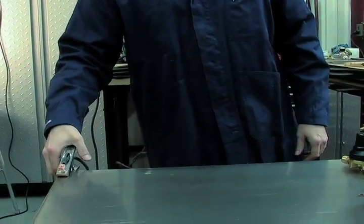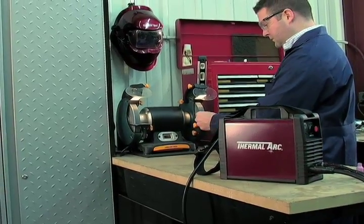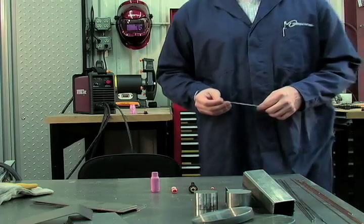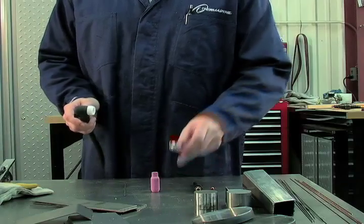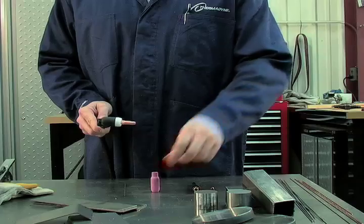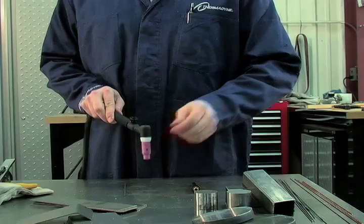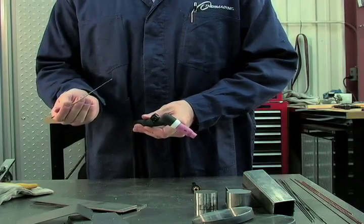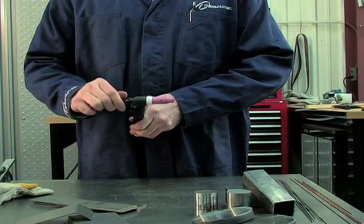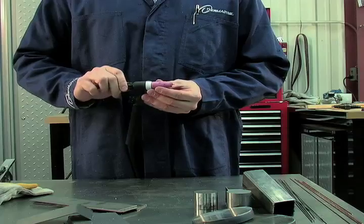Connect the ground clamp to your workpiece. The tungsten must be ground to a blunt point in order to achieve optimum welding results. It is critical to grind the tungsten electrode in the direction the grinding wheel is turning. Assemble the TIG torch in the following manner: screw the collet body into the torch, screw the gas cup on, insert the properly sized collet to match the tungsten diameter, insert the tungsten sharpened end first through the torch, and reattach the torch's back cap. Install the tungsten with approximately 1/8 to 1/4 inch sticking out from the gas cup, then tighten the back cap.